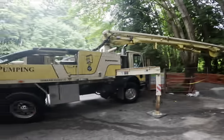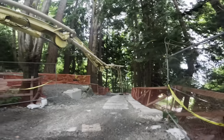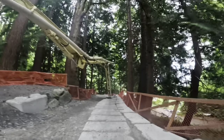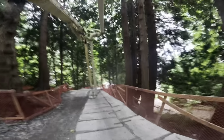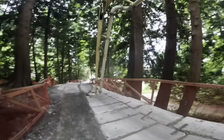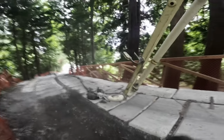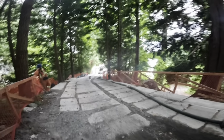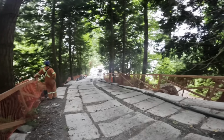Like I said, it's like 80 feet of 3-inch hose. We don't do pump into a pump via the deck pipe unless we're doing several hundred meters and trying to put down 80 plus an hour for a large commercial pour. For this kind of resi stuff, we almost always just go hose into hopper, just for logistical reasons. It makes way more sense, even though it is a little bit extra wear and tear on the second pump and a little bit more fuel burn.